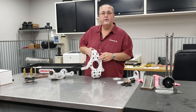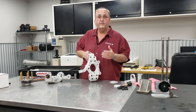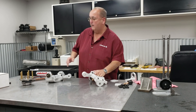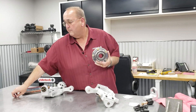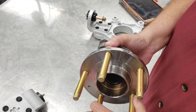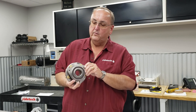We do not include the bearing hub as a standard feature because if you're a Corvette guy you may already have bearing hubs — no use buying another set. For guys that don't have them, we use the C7 bearing hub because it's stronger and more durable than the C5 and C6 units, unless you pay $460 a pair for the SKF race car stuff. This bearing hub works great on lots of applications — heavy cars, light cars. It's an option.